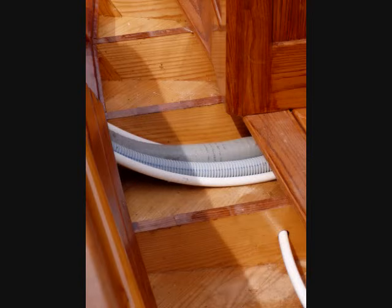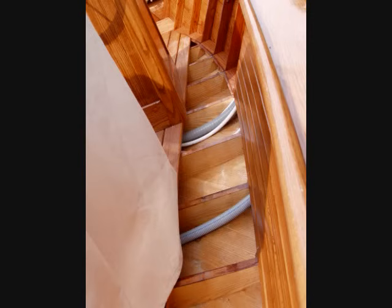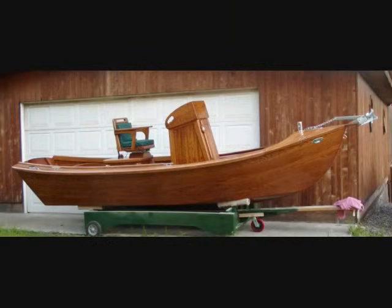In the bow, where the ceiling is omitted, spacers are fitted between the frames to support the ends of the sole planks. The sole, beside the layers of stain, epoxy, and polyurethane, is also coated with a dusting of 100-grit garnet sand to provide traction under the wettest conditions. Seated on her trusty shop trolley, the boat gets rolled out for waxing, followed by installation of the electrical system, the hydraulic trim tabs, and docking and anchoring hardware.